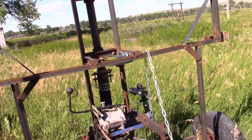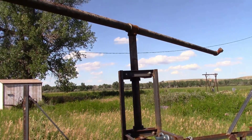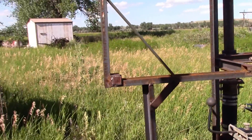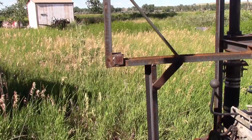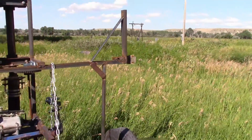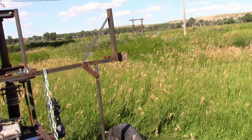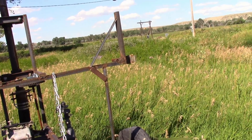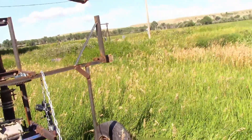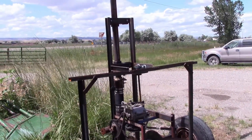In the middle is going to be a high-rise where the cables will come off to support it. Instead of hinges we're going to go with thread fittings for now, and if this works out then I might change them to cam locks. So all that has to be done to transport this is uncam the booms, disconnect the cable, and away you go.